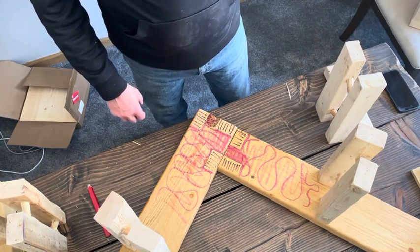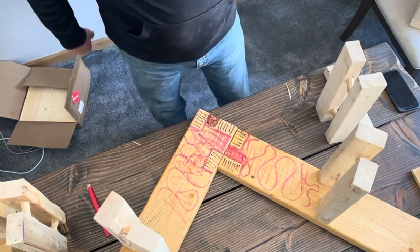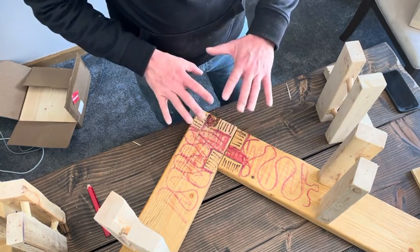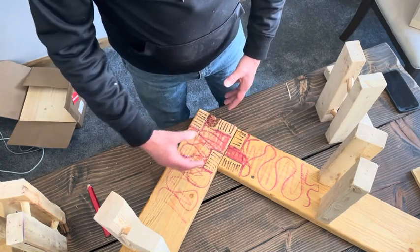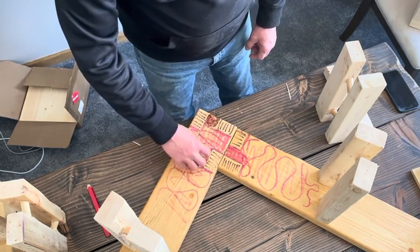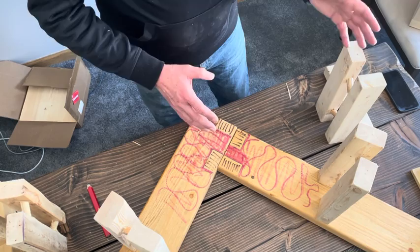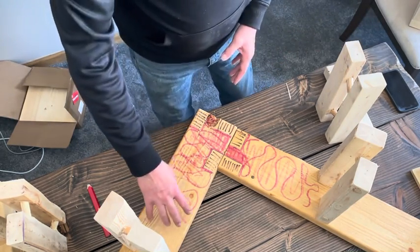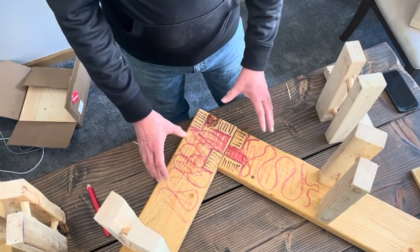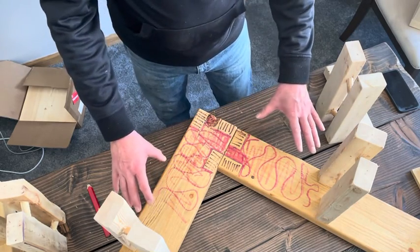In that wall assembly over there, you have 15 to 16 lineal inches of transfer — places for heat and cold to transfer all the way through. You only have the dowels here, and they're insulated. You only have four square inches of dowel in this one foot, and they're pre-insulated by having cellulose, fiberglass, or closed-cell spray foam around them. Look at all the places you have to keep that whole entire corner energy efficient. When you want to go from 24% BTU reduction to 50% to 75% reduction, all of these little tricks come into play to knock down places for heat and cold to transfer through the wall. This is a monster — 300% more energy efficient than that over there. This is how you build the T-Stud Perfect Corner. Thanks for listening.